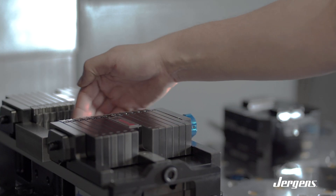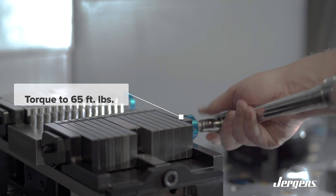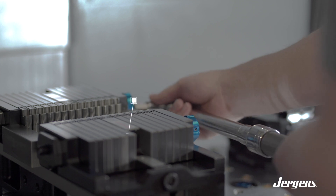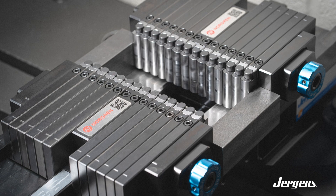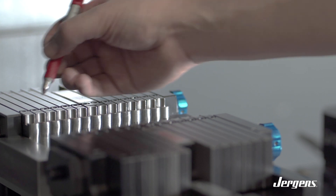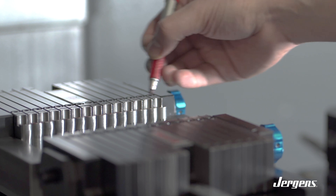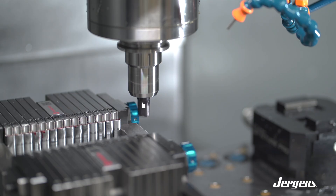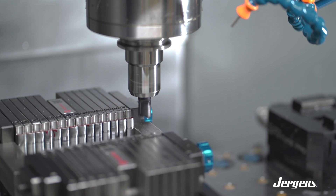Slightly push the fingers forward by hand to ensure there is no interference when installing the fingertips. We are clamping on blocks to stabilize the jaws and simulate the vise being in a clamp state. Mark the tips with a marker to create a witness mark. Have a 3/8 carbide end mill ready to dress your tips — we are looking to take off three to five thousandths.